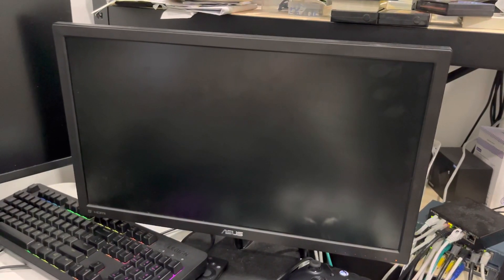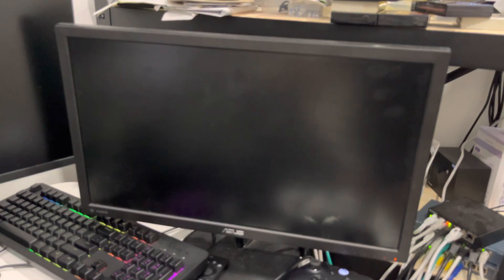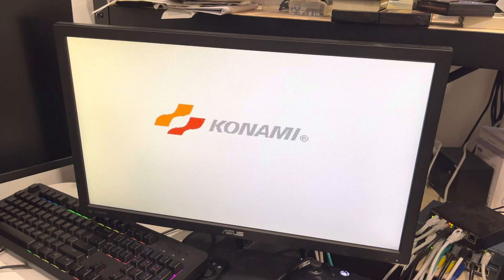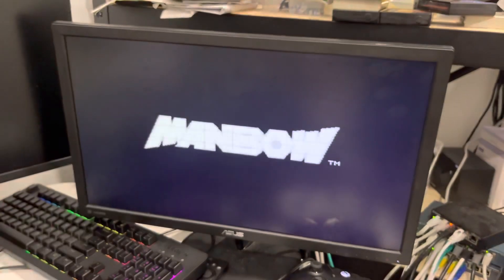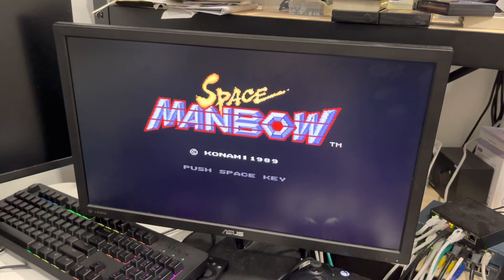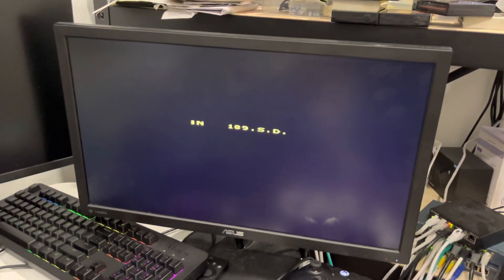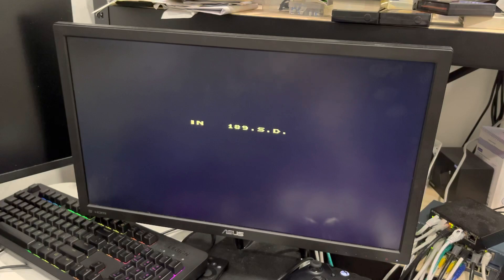As you can see, it's an MSX1. I did not change any ROM. I just replaced my 9918 with the 9958 implemented in FPGA using this board and one adapter that goes straight to the socket. The game is running, which means it's using the 128K of VRAM.